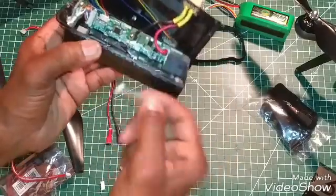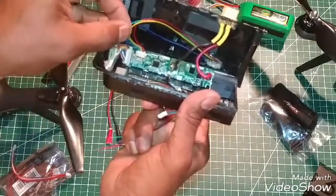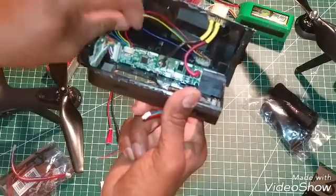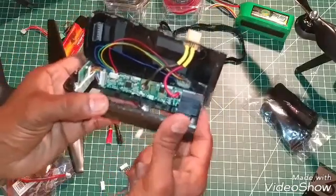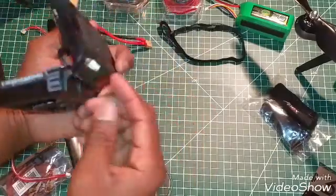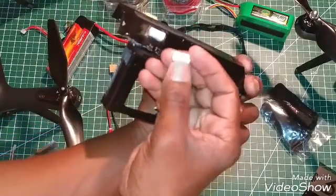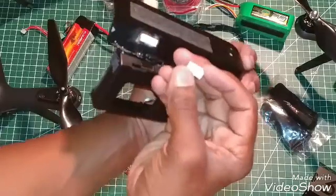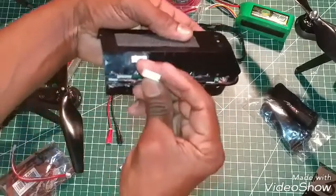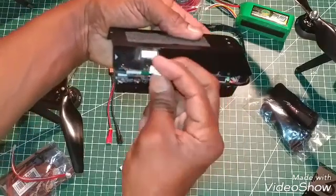The first wires I have on this plug as it plugs in are: blue, green, yellow, black, and red. Red is obviously your power and black is your ground. The way I have it plugged in on the other end — you notice the little notches on the bottom of the plug — those notches are going to face downwards. If the battery was sitting like this, the notches are facing down.